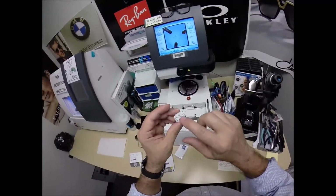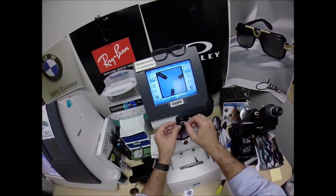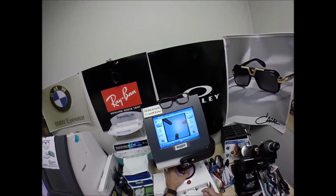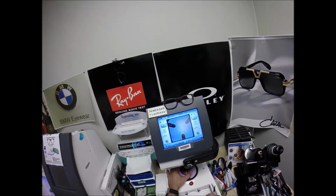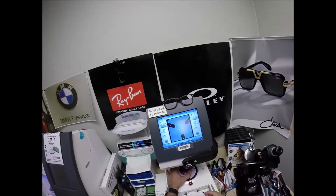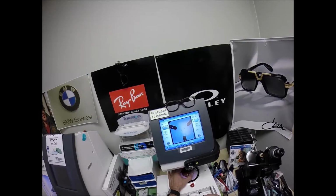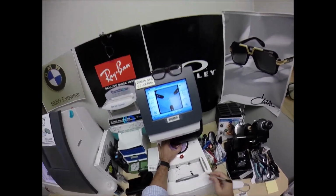Pull the paper away to make the black side sticky. Now on the back, that silver button is a magnet. It's going to do its job twice. The first time, it's going to attach itself to another magnet there in the arm. And get everything positioned and laid out. Make sure the lens is large enough. Woo! And it just is. All right, get everything laid out and hit that button. The arm's going to come down, place the block onto the right lens.